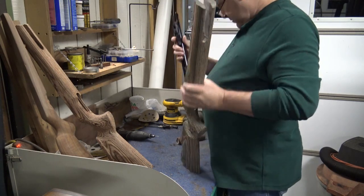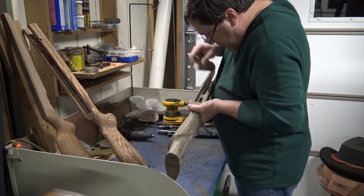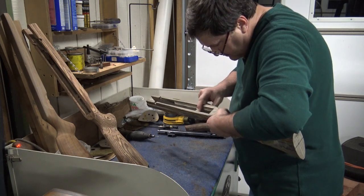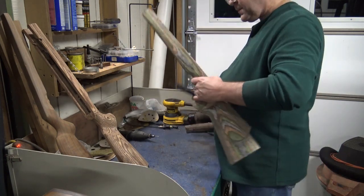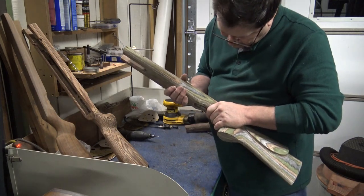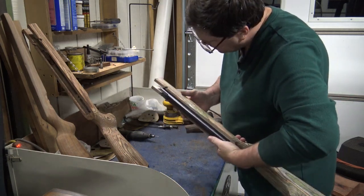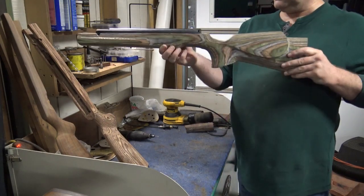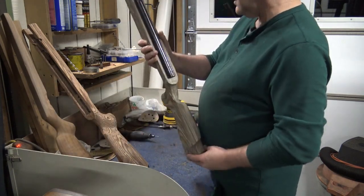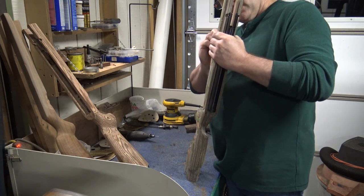That's just me bumping it, getting an impression on it, looking in the inlet and touching everything up. I'll cut this down quite a bit — scraping and sanding and squaring the ends where the action is so it'll be a good snug fit, so the action can't move. Anyway, I think that's about it. Appreciate y'all watching.